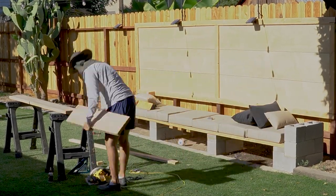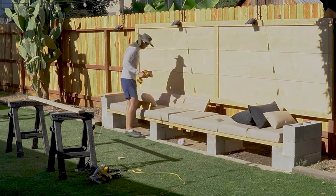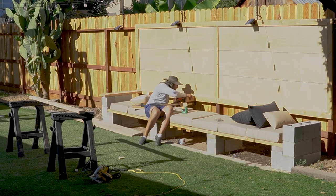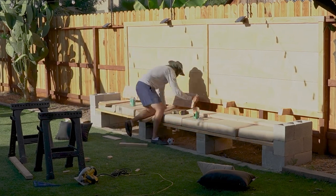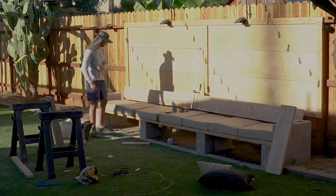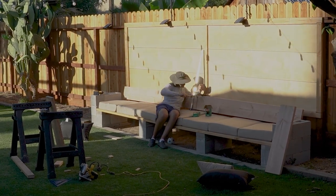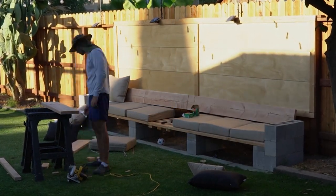Next I added a backrest. Initially I had no plans for one — the accent wall was going to serve as the backrest — but I ended up with a gap between the two, so I filled it in with a backrest. I cut it at a 15-degree angle because I found that to be pretty comfortable when you recline back. The backrest does kind of flow, and I'll show what I mean by that. I also had to attach the two individual boards together in the center so they're flush with one another.